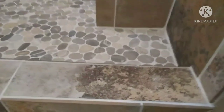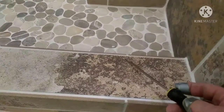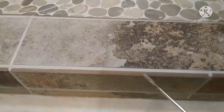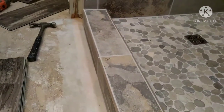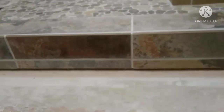Down at the bottom you can see there's slope from the outside to the inside, and the bullnose is down just a hair. I made sure that the grout is nice and rounded over more or less so the water will run off and won't get caught or puddle anywhere. Those joints on the top of the threshold I tried to make sure were as full as possible — concave just a little bit. Make sure when you're grouting that you keep that crack nice and clean if you're going to run your flooring up under it, which is what I'm doing.